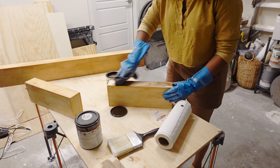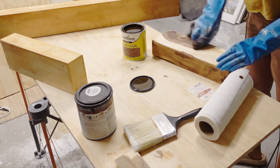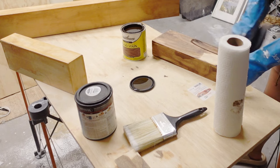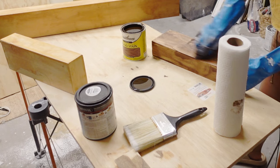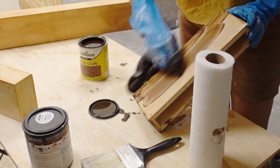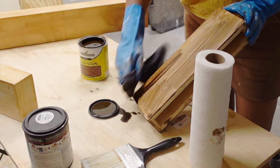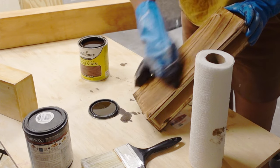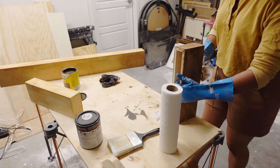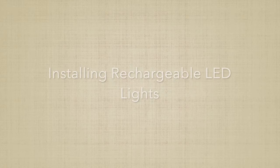That's my mistake — it happens in DIY. This was literally my first time making floating shelves and I think considering that, it turned out pretty darn good. But it could have turned out even better if I had sanded the wood filler better around the cracks on the shelves. When you do it, be sure to sand all the wood filler off, because what ended up happening is it stained a little bit differently just around the cracks. When staining, I basically just put it all on with a microfiber towel and then wipe it off immediately after.